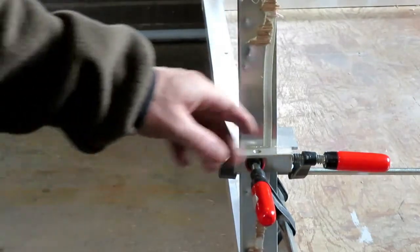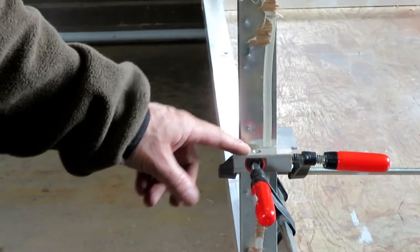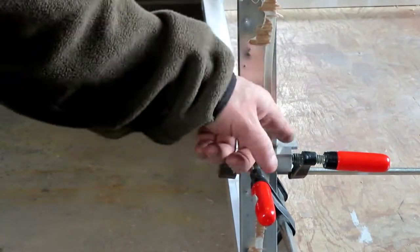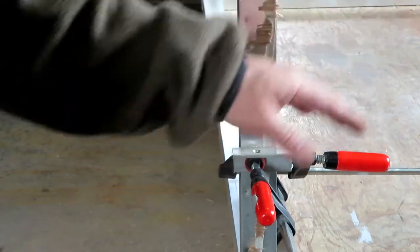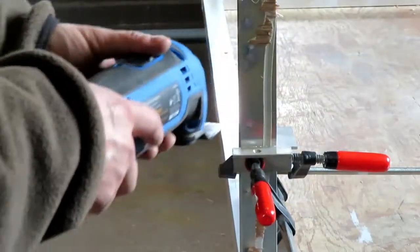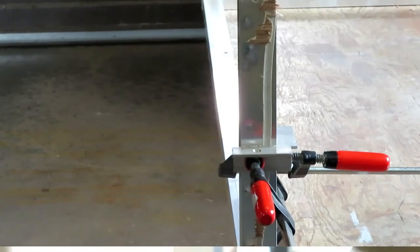What I decided to do is I had some old angled aluminum stock. I cut a couple of small pieces and clamped them around my scribe line on both sides, so that when I cut with my multi-purpose saw the blade can sit level as I cut through. Hopefully that will work.